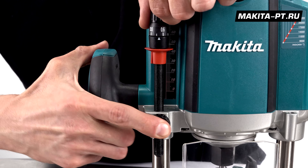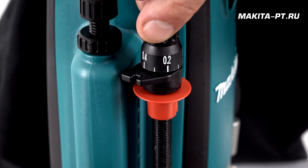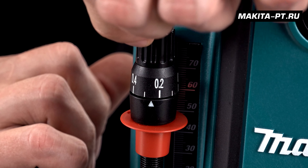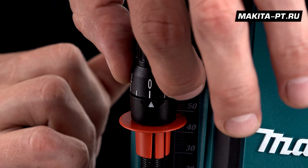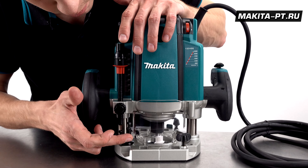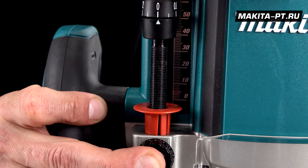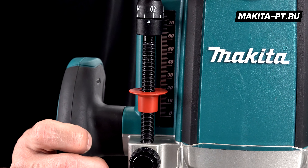First unscrew the safety washer, press the button, and slide the pin as needed. Be careful not to pull the upper part out completely, as it holds the pin and carries the reference arrow. Manual rotation of the pin is done only with the upper knob — the lower graduated washer does not regulate anything. Set the arrow to zero on the washer, then plunge the body until the bit touches the surface, lock with the lever, lower the stop pin, and rotate the washer to zero. Move the red stop to zero as well, then release the lock and select the desired cutting depth. Fine-tune with the micro-adjustment and you're ready to work.